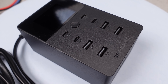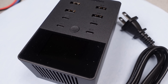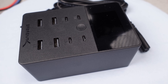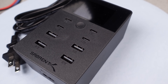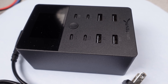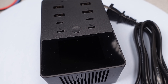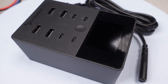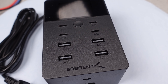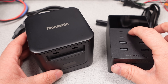The Sabrent is an interesting device. It has very clever power distribution, which is very welcome in a higher power USB brick. The split of the two sides is also smart because it lets you pick which ports are doing what and get the most out of the adapter without concerns of the power turning off. Now, if you want a device for all low power USB devices, it's kind of wasteful because at no negotiation — for example, 5V only mode — it's really only a 120W adapter, but it will power many 5V devices without complaint. For testing needs, the screen is nice and accurate. It has the safety listing and a lot of prerequisites for power adapters. It stays on and it has reasonable isolation. The idle power is on the higher side and the efficiency is not class leading, but as a test device or something you have on an off switch, it may make the grade. It's going to beat the pants off of a low-grade wall wart.